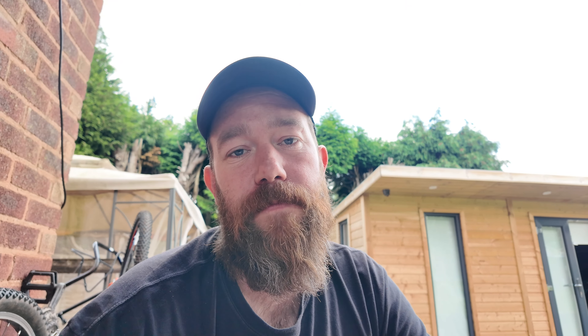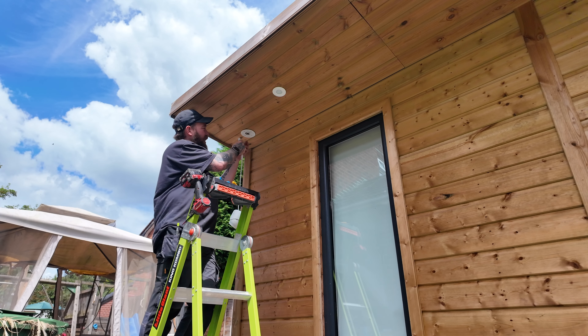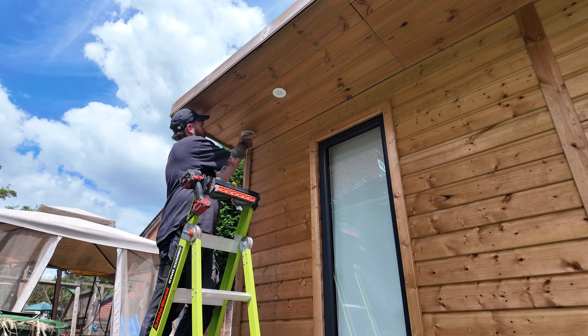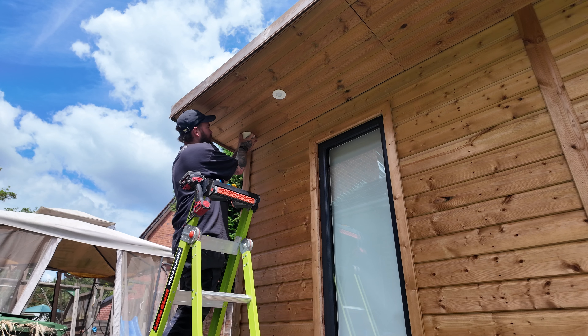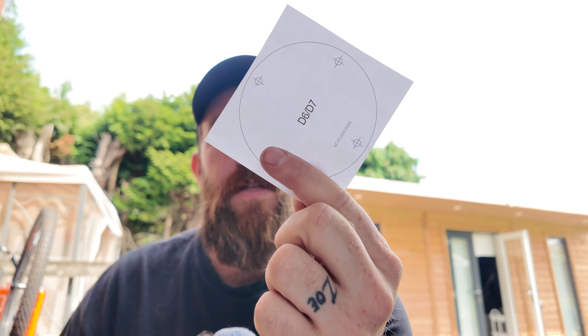First thing I've done is take the old camera off and convert the end to an RJ45. If you're not confident making leads or don't have the tools, you can buy pre-made leads from most wholesalers, eBay, or Amazon. Then we screw the base onto the ceiling, plug the camera in, pop the slack up into the ceiling space. It's worth noting all these cameras come with all the hardware — screws, cables, and a drilling template.